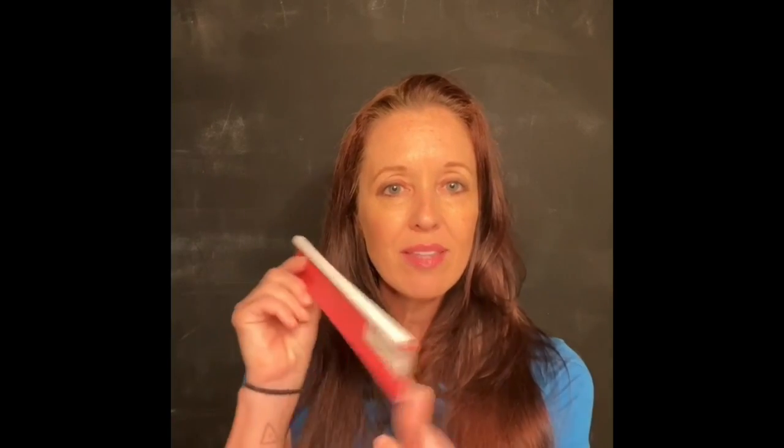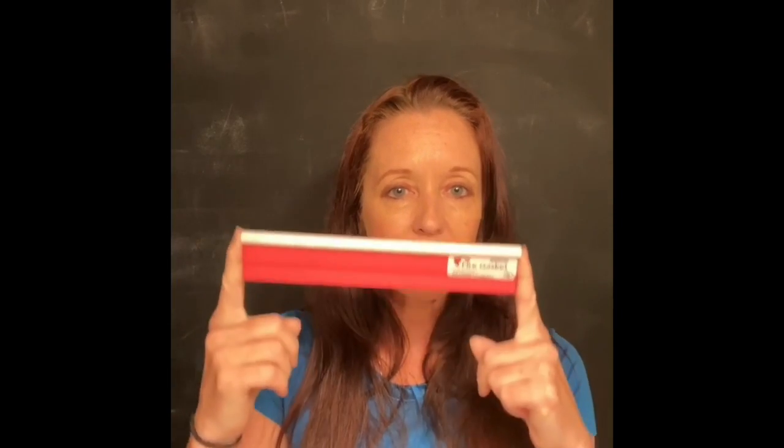Next up, we want to talk about what to look for to ensure the fire gasket is properly installed. It seems silly to say this, but I want to cover all the bases here. You have to be sure that the product is not installed upside down. That means that the bubble gasket needs to go against the concrete, the white side against the concrete, and the pink vinyl section against the drywall track.